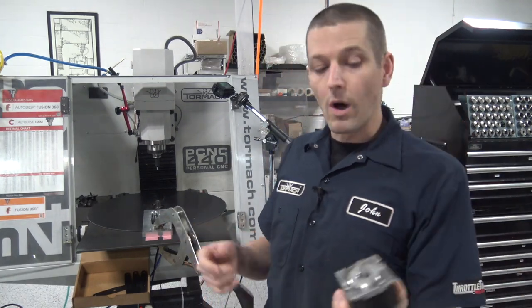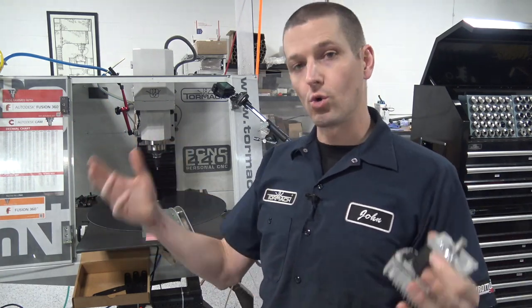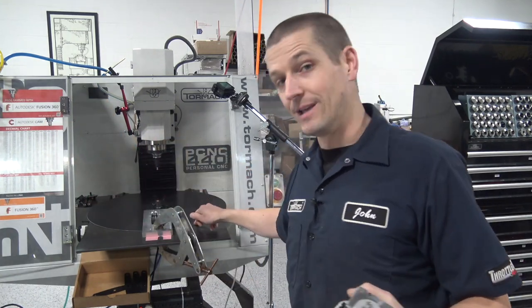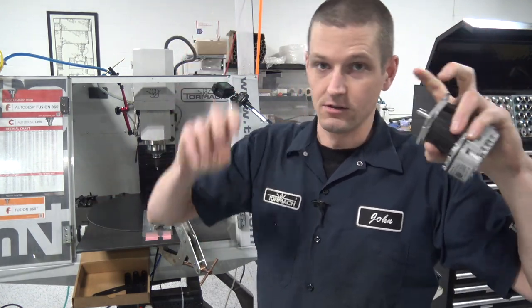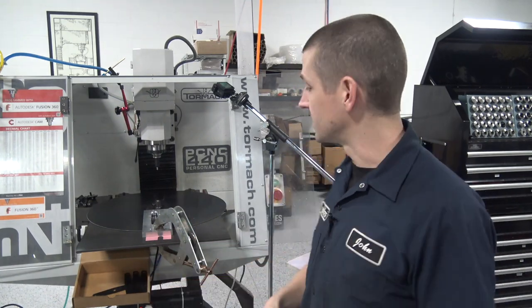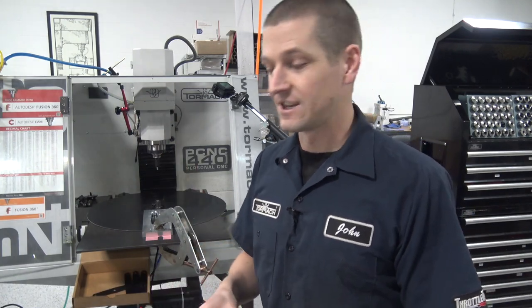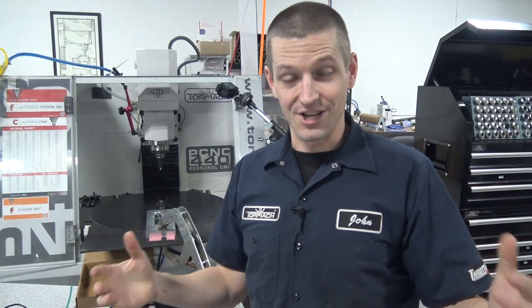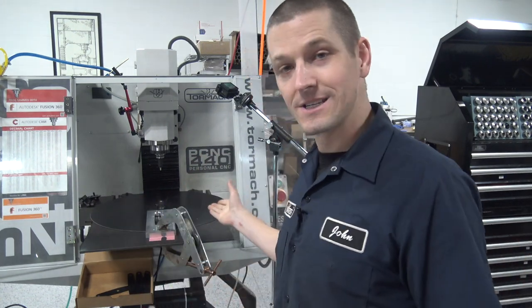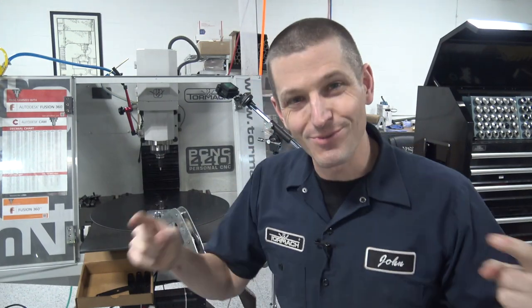The regular ClearPath didn't work. Here's why: when you're out on a 22-inch circle, you've got way too much torque requirement at that outer radius. One of my goals for 2017 is to learn more about this stuff scientifically. But you need some mechanical advantage, and a gearbox is the answer. There's the gearbox mounting right to the ClearPath motor. ClearPath is amazing as a company — you can talk to a real person when you call them. They helped us get that gearbox. It's a 100-to-1 gear ratio. We are rockin' and rollin'.